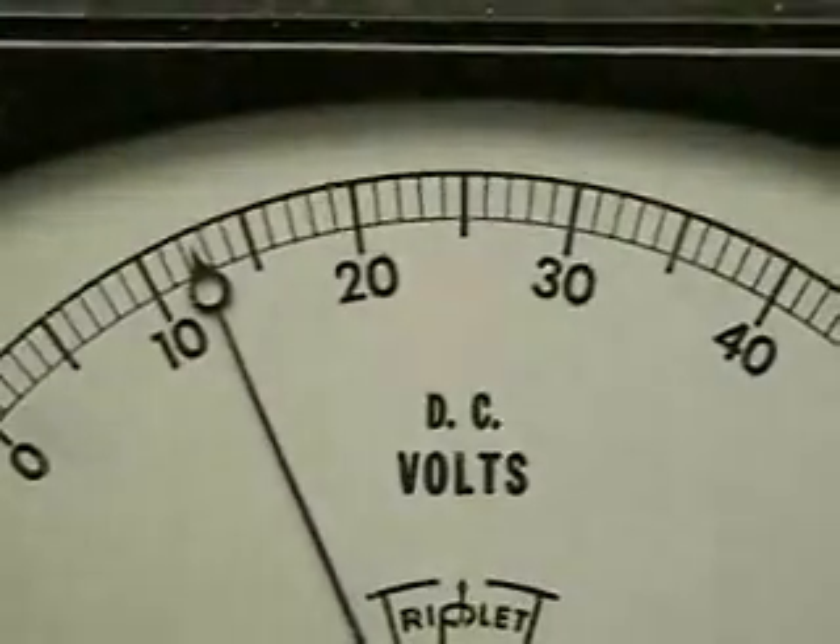The Series 3L has two electrodes in place on the top of the unit. It also enables you to open the unit up — it's got a seal on the top which allows you to gain access to the plates. This is a 15-plate system with room for an upgrade for another 15 plates inside, bringing you to 30 plates. The plates are 3 inches by 5 and a half inches and are stainless steel. As you can see we're still running around 12 volts, which is not enough, but we're getting plenty of hydrogen out of here.